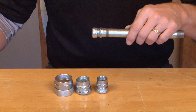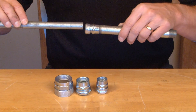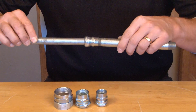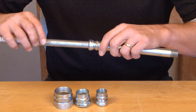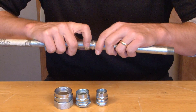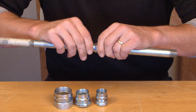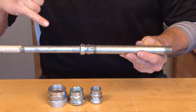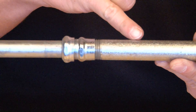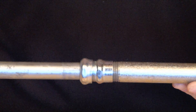At this point, we're ready to make a transition to the EMT conduit. You simply take your EMT conduit, slide it right in until it hits the stop, and then tighten this compression gland. You now have a UL listed transition that goes from EMT conduit to threaded rigid conduit, and a smooth wire pull can proceed.